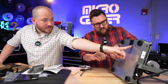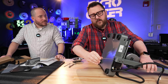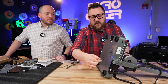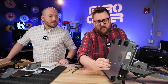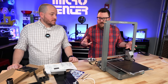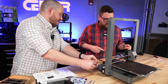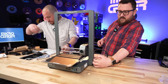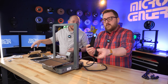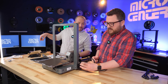If you look here, I think this is going to be the motor for the bed, the Y axis. When putting on the upper gantry on 3D printers, it's good not to completely tighten every single screw - leave a little bit of wiggle room and then go back around to all of them at the end once you've gotten them all basically tightened. This spool holder goes in, twists to lock - no screws or hardware necessary because you've got these two keyhole style bolts.